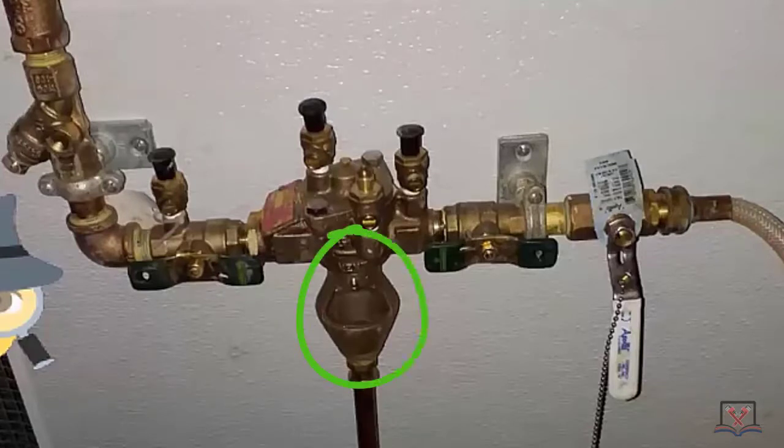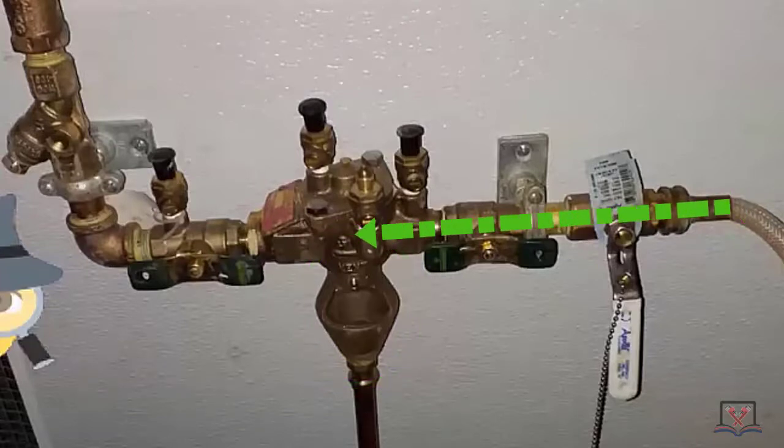That's an air gap fitting. A lot of talk about air gaps. But in a backflow condition, it's going to hit the checks. Rather than go into the potable water, it's going to dump through this drain.